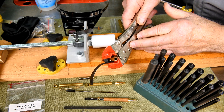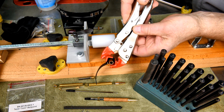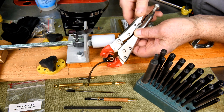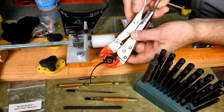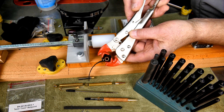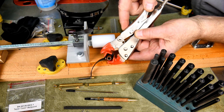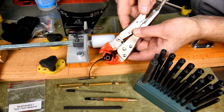I've used a piece of rubber from a tire inner tube here to sort of take up the space around the clip so the vise jaws are not pressing on the clip. I still have to be careful though — I can't squeeze it too tight, because one of two things can happen or both: I can crack the wood, or I can collapse the brass tube. It's already really, really tight for some reason — I don't know if it's because there's glue in there. If it doesn't work, I'll have to go to Plan B.